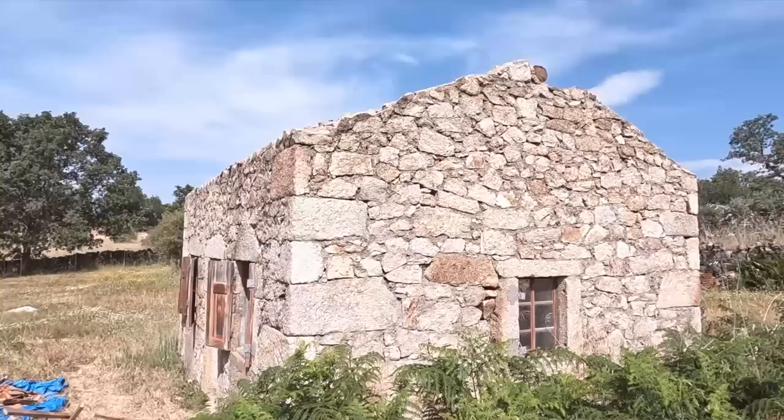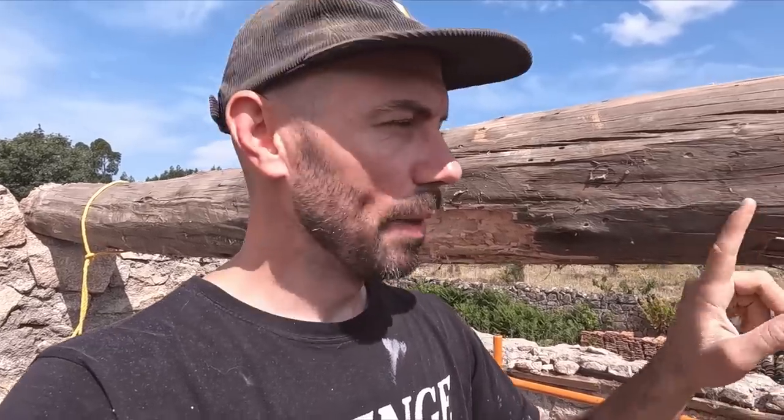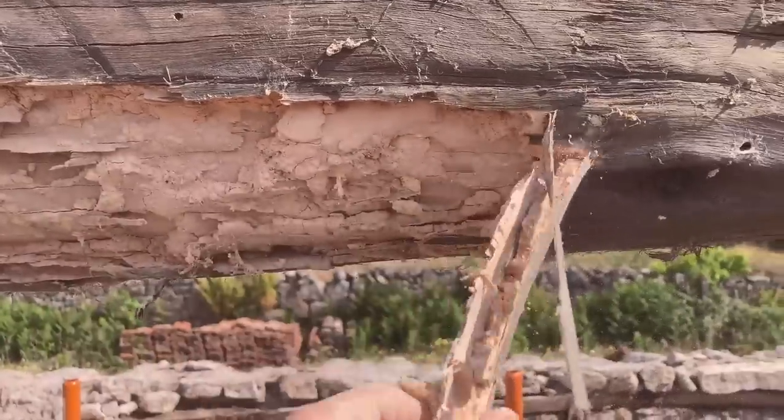What a difference one day can make — from the thunderstorms yesterday to this beautiful sunny morning. Before we start and try to get this beam down, just wanted to address comments asking why we can't just keep the beam up. This beam is really not in good condition: it's riddled with woodworm, with areas that are literally just crumbling and dusting away. It also has carpenter bees going in and out of it, and where the roof has been leaking for years it's got really wet. Keeping it is not an option — we want fresh wood in. It's more work, but definitely worth it.